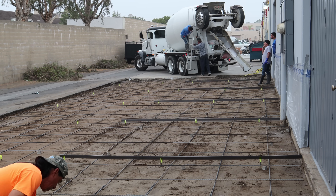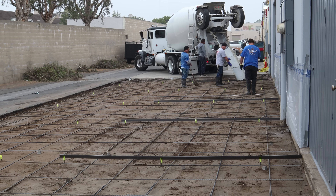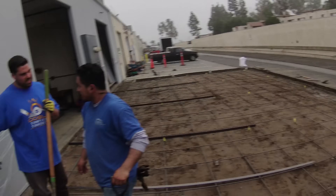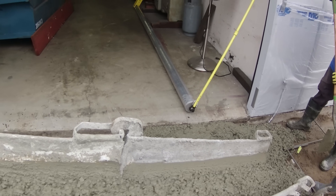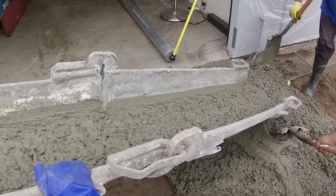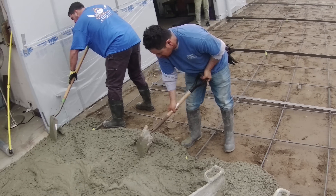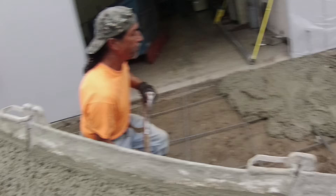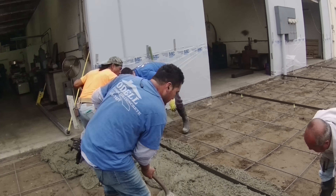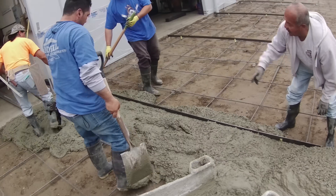Hi, David Odell here with Odell Complete Concrete. This is day three on this job site and part two of a two-part series. Here are those screeds I was talking about in part one — it's part of a spin screed system. You can see it there in the garage. It rides on top of metal runners: a 5/8 steel stake or short piece of rebar, with little chairs that sit on top of the rebar, and then a two-inch quarter by 12-foot steel piece sets in those. The spin screed sits on top and comes down to screed it off.